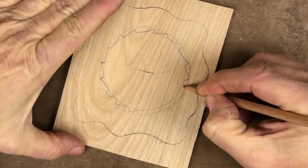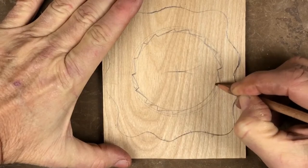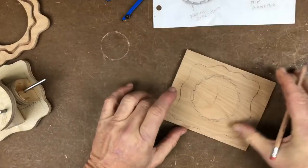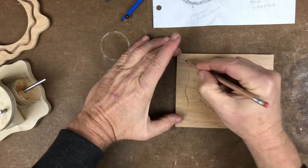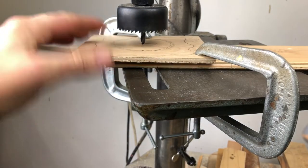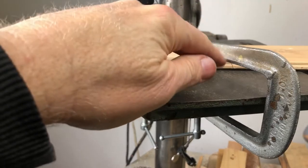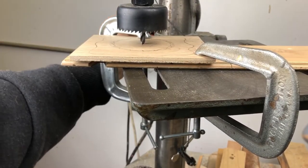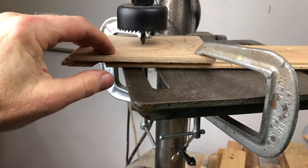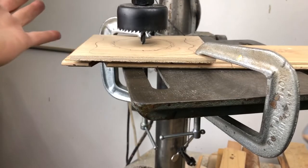I'm going around drawing in the ratchet teeth — not really ratchets, it looks like a ratchet but it's not going to act as one. It's going to act as a kind of an actuator, pushing on the fish as it goes around. I'm set up on the drill press and I'm going to cut this hole in the base with a hole saw. I have it well clamped to the drill press and the drill press table locked down tight. Here's a handy tip: to set the clamps, I brought the drill down and locked the drill press so the bit held the wood in place while I put the clamps on. The reason I've gone to all the trouble to clamp this carefully is that a long time ago in college I managed to cut my thumb in half with one of these — and I don't want to repeat that experience. It can really pull you into the work piece, so you want this locked down.